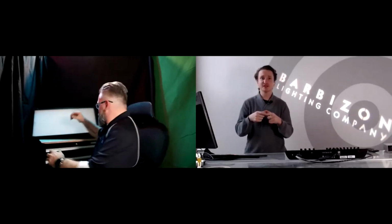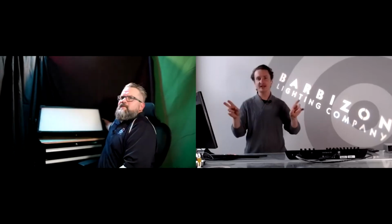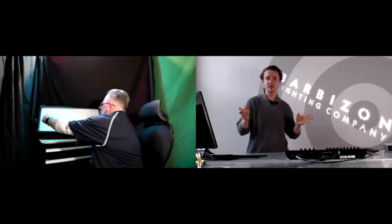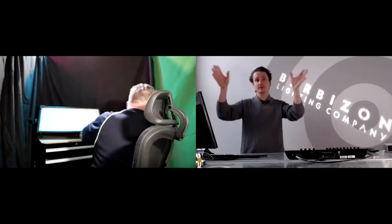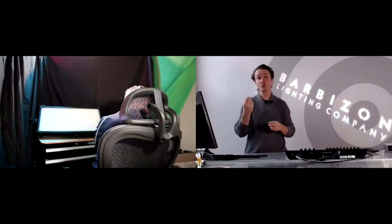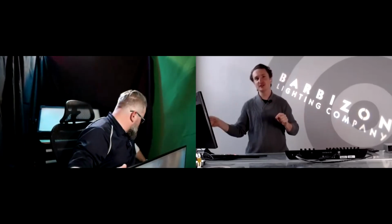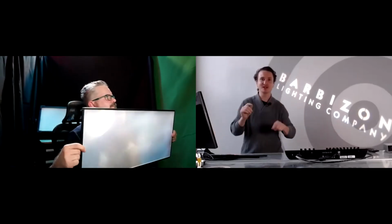Just if there's anybody on the call who's not familiar with what these words mean. Remote phosphor refers to, rather than the individual chip being calibrated, it excites a layer of phosphor that is calibrated to glow at a specific white, usually a white point. There are fixtures where the whole unit is remote phosphor, so you've got a bank of very deep blue quasi UV LEDs that excite that layer of phosphor for it to emit. The benefit, as Darryl was saying, is that it's a very well calibrated, very true light on the white light spectrum. And since amber can be considered the very low end of the white light spectrum, you can calibrate a color right in there.